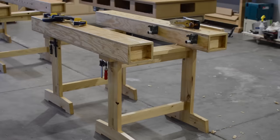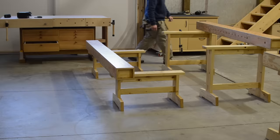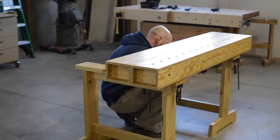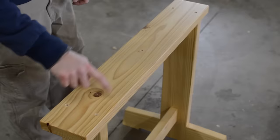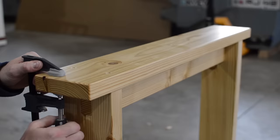Here's a look at the jobsite version. If I'm hanging some moldings or installing doors or something, I can bring this to a job site and have a nice sturdy workbench. For a little extra credit, I made some low sawhorses. These are great for when I'm working on case pieces that I would otherwise be working on when they're on the ground. The two beams can also be bumped together for a 15 inch wide work surface if you don't feel like putting a sheet of plywood over top. Two key features to these sawhorses: the top can be removed and replaced with five screws, and I can clamp on all four sides.